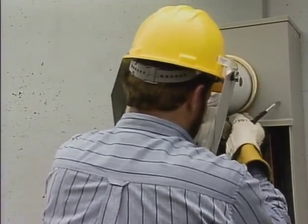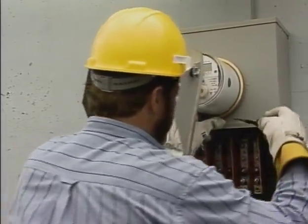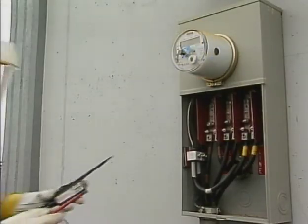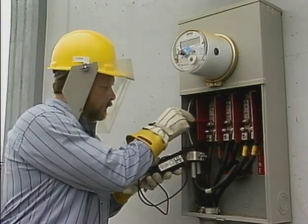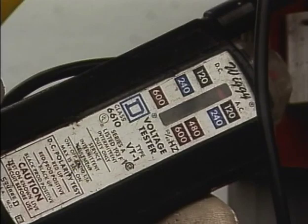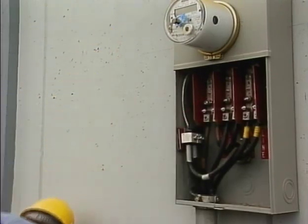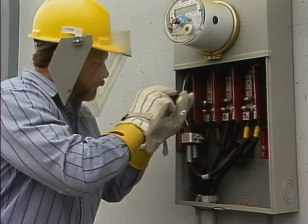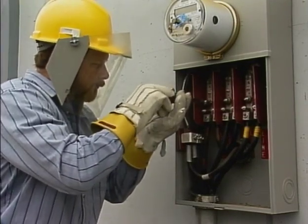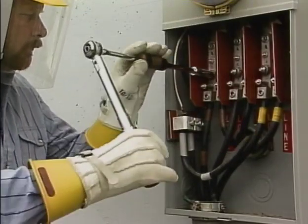Now all that remains is to close the meter into the circuit and the installation will be complete. He begins by checking the voltage across the bridging nut on the line side of A phase. He gets a fraction of the normal voltage. This is expected because the voltage is being split between the voltage tester and the phase's high impedance potential coil in the meter. So he knows that it's safe to close the bridging nut between the line termination and the